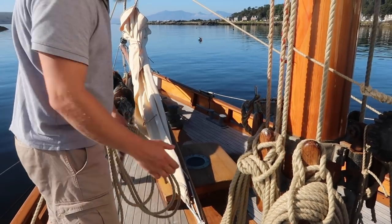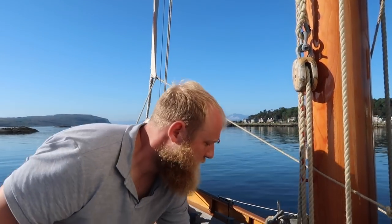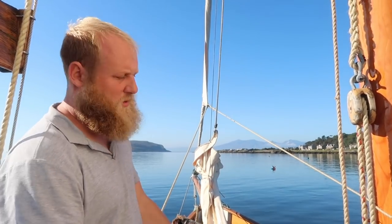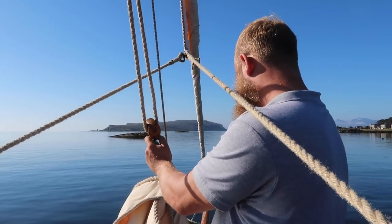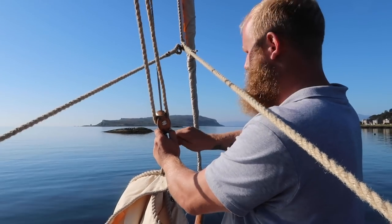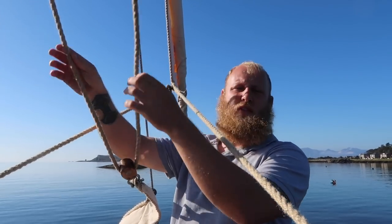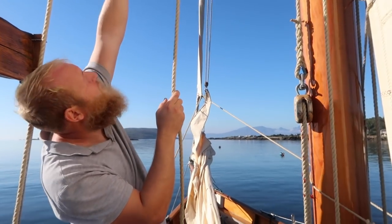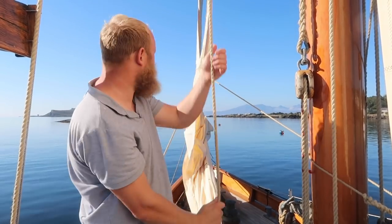At some point over winter I'm going to get more blocks and rove this all the way back to the cockpit so it can be controlled from there. At the moment to reset the sail you have to come forward and do it here. The staysail halyard is here — I need to slack it off because I always have it set up with a piece of rope on the forestay that I connect it to, so you can pull it up tight and it won't go anywhere. First thing we do is take that off and let it hang out of the way, then reattach the halyard after checking it's not twisted.